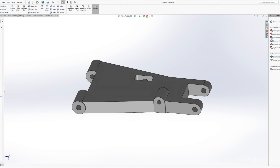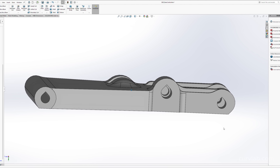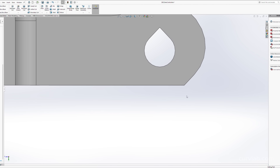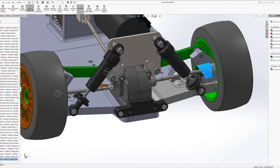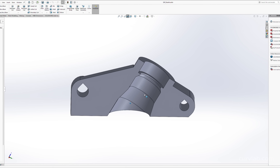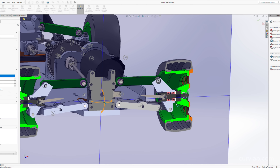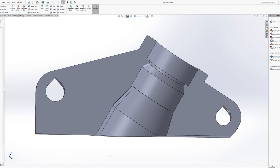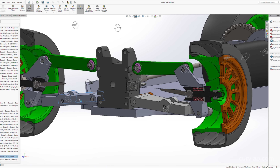We also needed to create a really beefy and stiff control arm that can be 3D printed. I designed features like teardrop-shaped holes so it can be printed without support, since the overhangs have a maximum of 45 degrees. This part also needs to leave clearance for the knuckle to articulate through the whole range of suspension travel. The same philosophy applies to designing the knuckle — I tilted the whole part to print on a specific plane and designed bearing press-fit features such that none of the faces exceed that 45-degree overhang, so the part prints easily and functions perfectly.